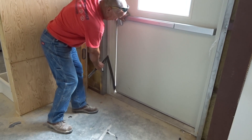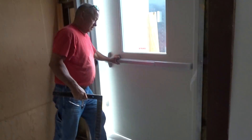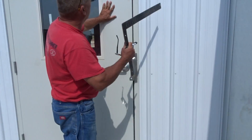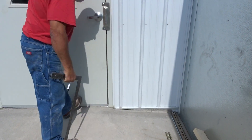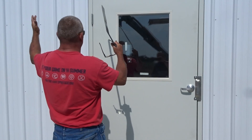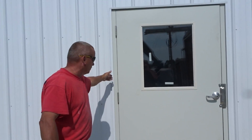There's a gap right there and this over here is solid. On the outside, with the door closed, I have an eighth-inch gap in the head and three-quarters to five-eighths at the bottom. So the whole door frame is going to have to come out and the whole door is going to get racked back and plumbed in order to make this work.